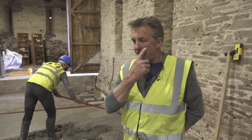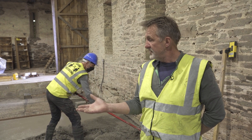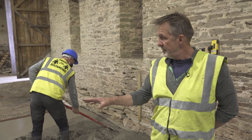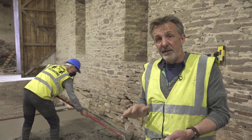It's always hard to give precise water content in mixes, because sands will come in containing varying quantities of water. This one we've actually laid just that little bit wetter than we'd normally do it, because it is going to be a polished floor — we're going to float this up so it needs to be able to pull the fat up in the polishing process.